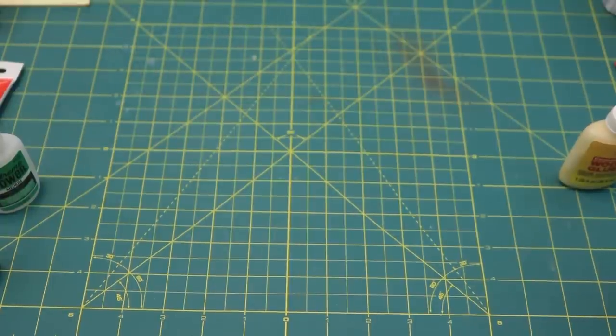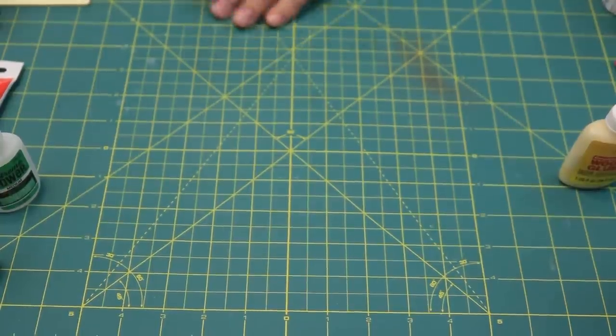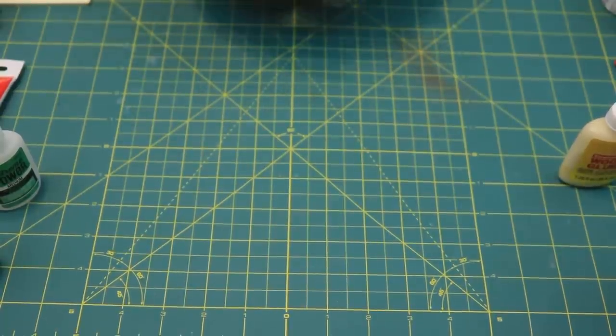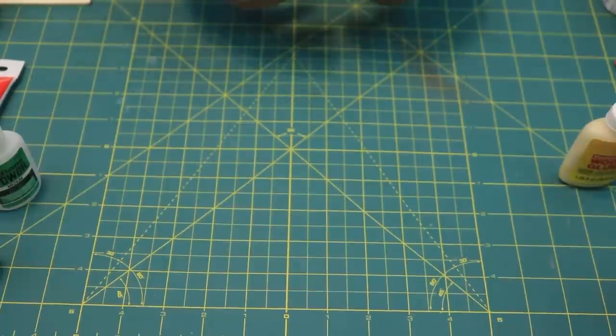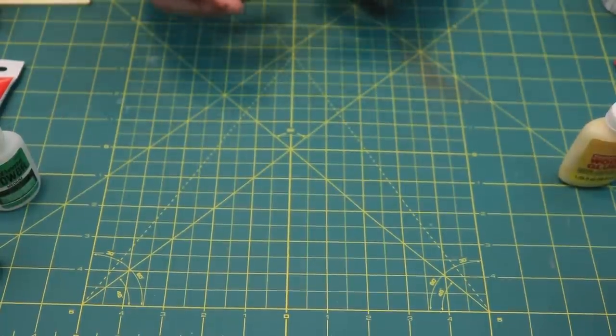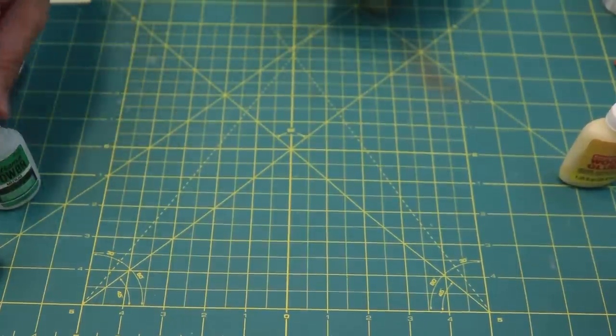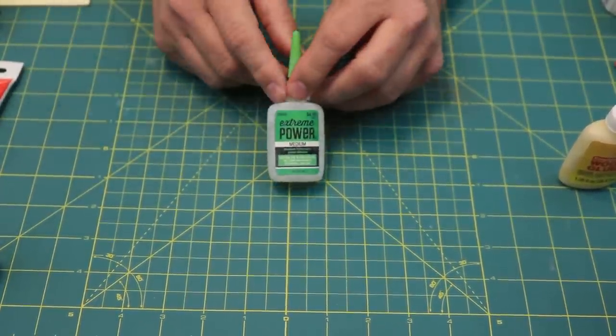It's also important for us to ask, not only do we have a porous or non-porous material, so I'm using the right glue for that, but also are my materials similar or are they dissimilar? In other words, it's one thing to be gluing two pieces of styrene together or two pieces of wood together, but it's a completely different thing whenever I'm gluing a piece of wood to a piece of metal. And so that's when we want to, again, in most cases, use a reactive cement.